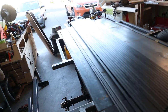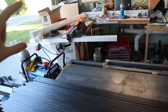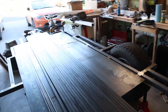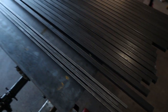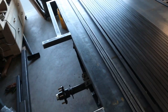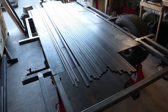On the front box it's going to come up about 2 feet, and I want to do just a rail around the front and two sides so you can put stuff on top and strap it down - extra coolers, firewood, plastic totes. I also got a 4x8 sheet of 16 gauge steel. I'm going to use some 1 inch tubing and make a three-sided fender, and I'll probably use the sheet for something else as well. I just got a whole 4x8 sheet since I'll likely use it for something eventually.